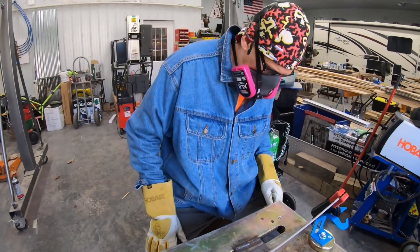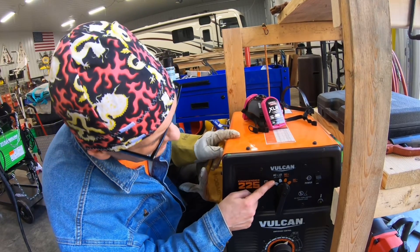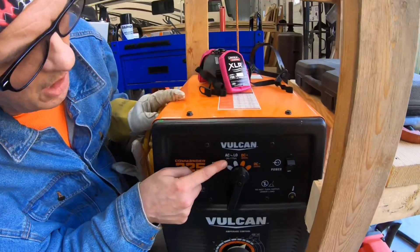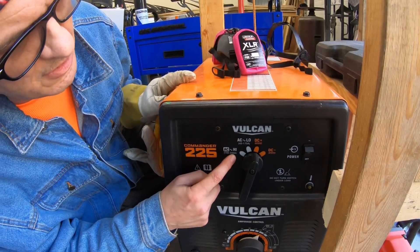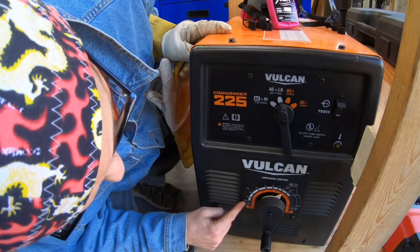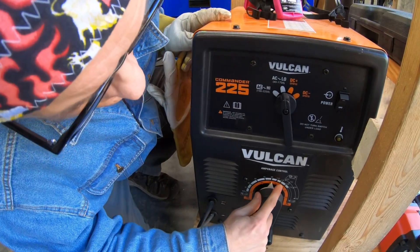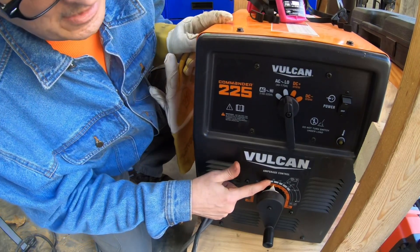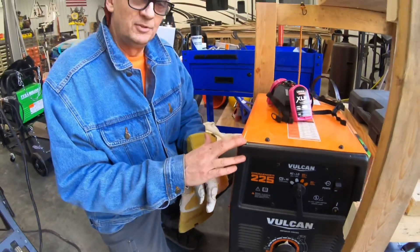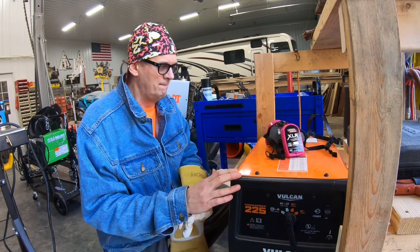Let's switch it to AC and just see the difference. Anytime you change the settings on a machine, it says you're supposed to turn it off. So we'll turn it off and go from DC positive to AC. It looks like it will be at low because we're going to stay at 90 amps. AC low is from 40 to 170, high is 150 to 225. So we'll go to AC low. Now we're on this graph — to stay at 90, we've got to turn it down just a little bit. 90 DC is 130 AC on these settings, so we're back at 90 amps on AC low now. The reason I call these buzz boxes — these transformer machines when you're running on AC make a distinctive buzz. So let's try and run a bead on AC and see if we can hear that.